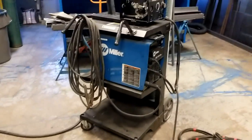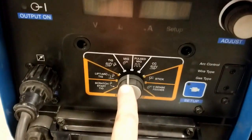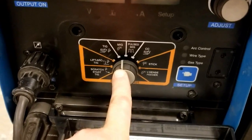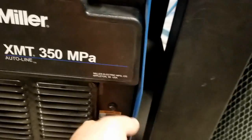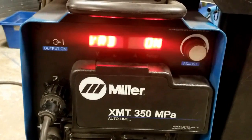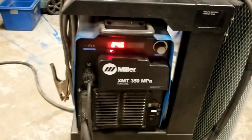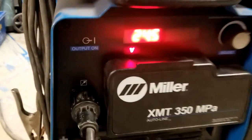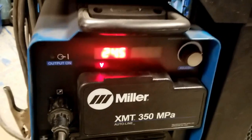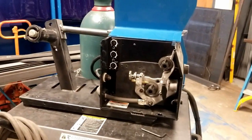We have power — all electrical connections are hooked up. I'm going to open the lid, make sure I'm on MIG mode, and flip the power. If everything's connected the machine should cycle up, go through a couple of screen changes, and then ultimately display 24.5 — which is just the voltage the machine is set on. These particular machines make a little clicking, musical, weird noise — that's perfectly normal, don't worry about it. Next video we'll start hooking up the wire and the drive rolls.